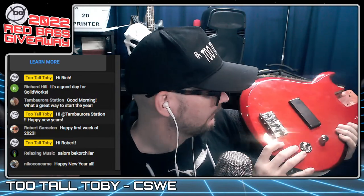So I think the way I'm gonna do this is gonna be very similar to what we did on the front side. On the front side, we had this one that ran all the way around and up to the horn. And on the back, we have a very similar scenario where we're starting out up here on the horn and we're coming down. If you could imagine, that's probably connecting here. This is probably all one continuous pass. And then there's an additional cut that cuts out this region here. In fact, if this was done with manual machining, that's almost certainly how they would do it. But this is probably CNC'd, so they probably do it all a little bit more elegantly.